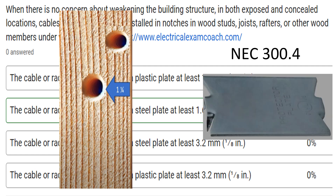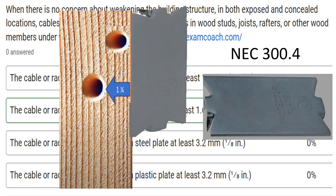If you've never seen one of these, it's literally just a little steel plate. It's got some teeth on it. You're going to take and line it up with where you want to protect, and you're going to bang it onto the stud. That way, when the drywaller comes and installs their drywall, if somebody does go to screw a nail there when they're hanging their drywall or hanging a picture later, they're not going to shoot it directly into the wiring.